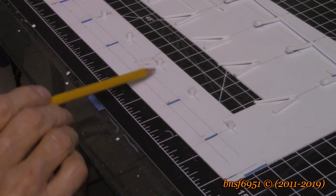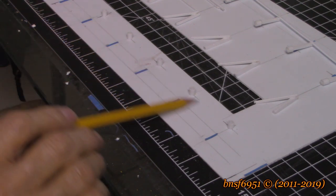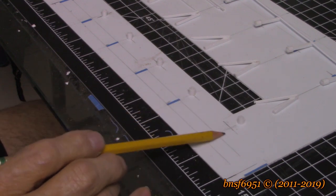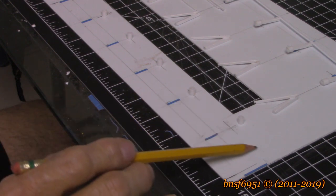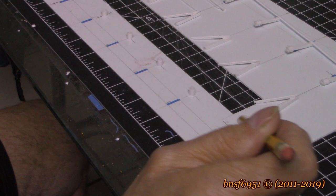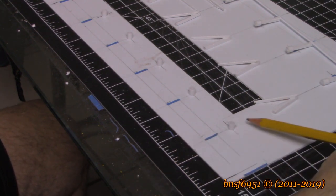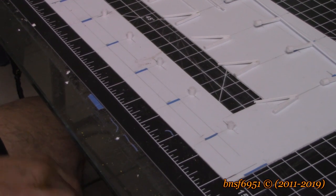Right now I am preparing to mount my footings for the crane support structure. I have a crosshair here — the important line is the one that goes from the back to the front of the building, which determines the width between the two sides, so that has to be right on. I'm going to push these guys over the crosshairs and when the X is in the middle, that's where it gets glued.